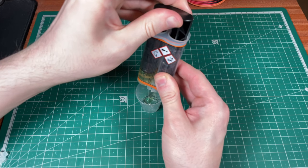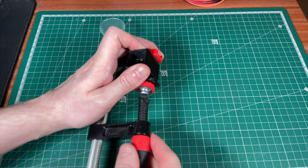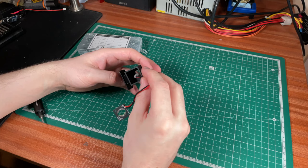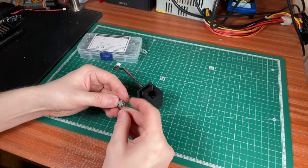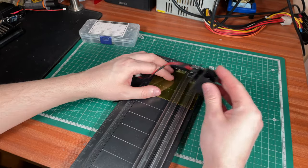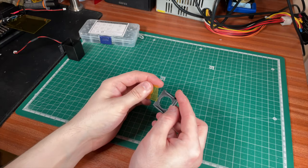The spotlight housing also needs assembling, and to do that, I'm gluing the spotlight stand to the main body with epoxy and then letting it cure overnight. Once dried, I screw in the spotlight PCB and then fit a 286 bulb, otherwise known as a car dashboard light bulb. For the spotlight colour filter, I'm using some spotlight colour filters, cut down of course to the small size, which is then clamped between the body and the spotlight face.